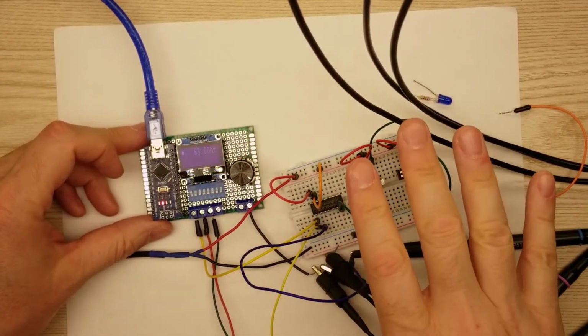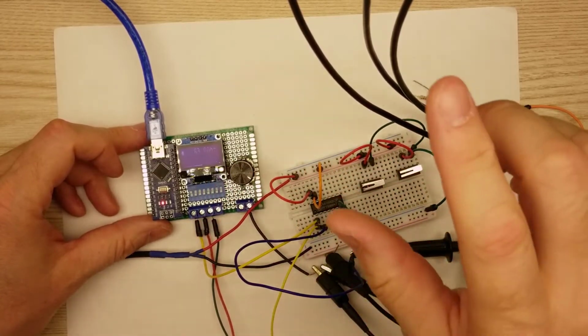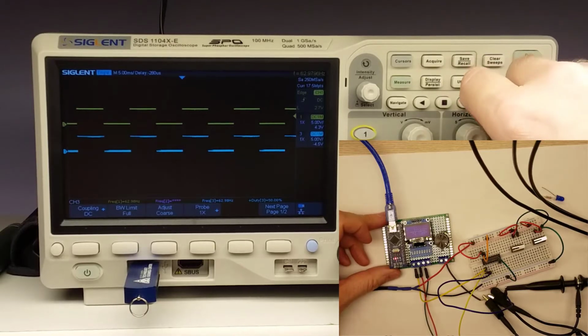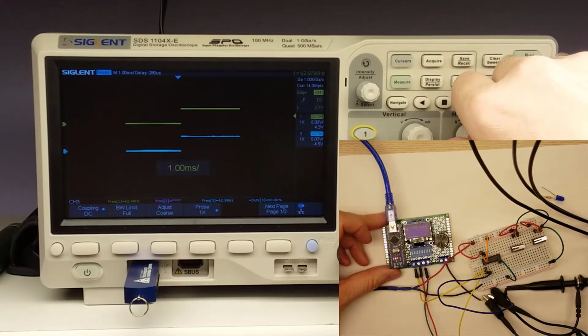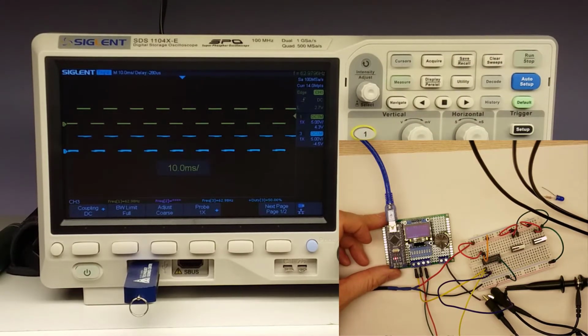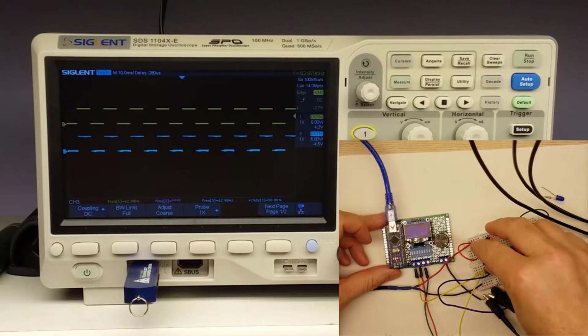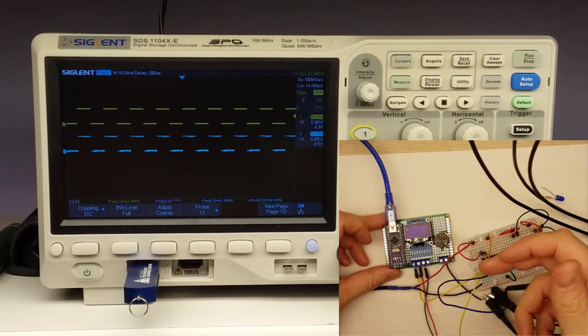Now, right now, we're obviously just running it in a digital mode. We've got a high and a low. So as you can see on the oscilloscope, it handles it just fine at 60 hertz. Wouldn't really anticipate it any other way. It's pretty slow. I do just have the control input wired high, so it's always going to be on, and we'll mess around with that here in a little bit as well.